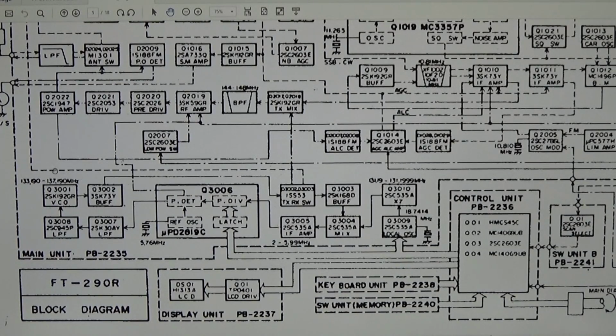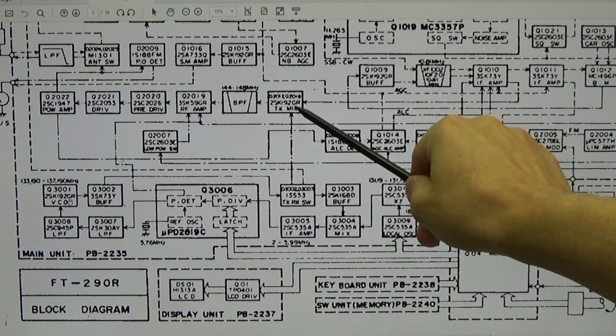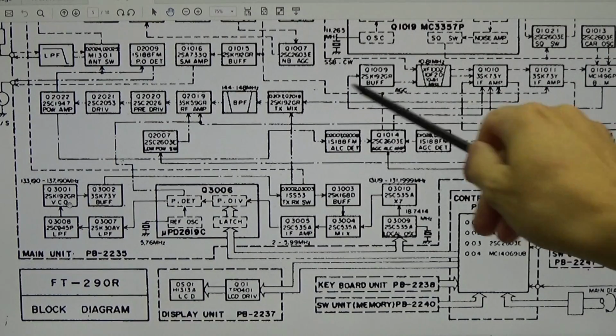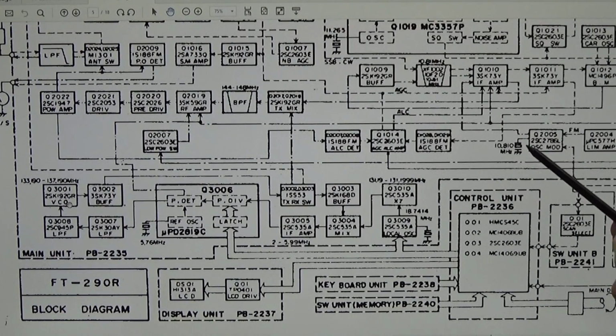And you have seen on our counter 134, which is within the range of our VCO. From the other side we get, through an IF amplifier, our fixed oscillator frequency, which is directly connected via this limiter amplifier. It is directly connected to our microphone, and this is a fixed frequency of 10.81.